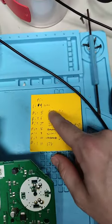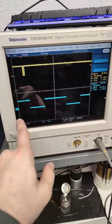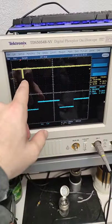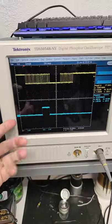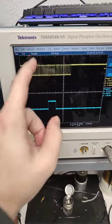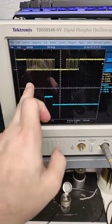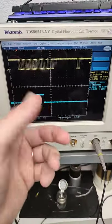You can see what I've kind of figured out from the pins here. That's showing the square wave on pin 7, and this seems to be the serial data on pin 10. Pin 9 — I'm not exactly sure what it does or what the point of it is. And then this is that data pin again, just kind of on the time scale of it. I'm pretty sure we're looking at serial data here, but I'm not a hundred percent sure.